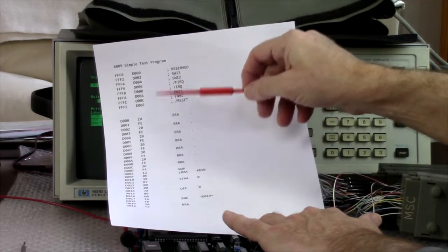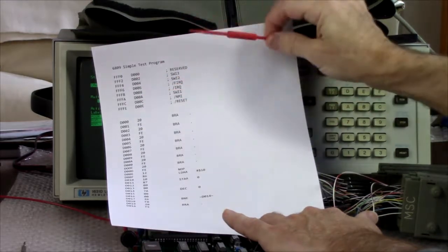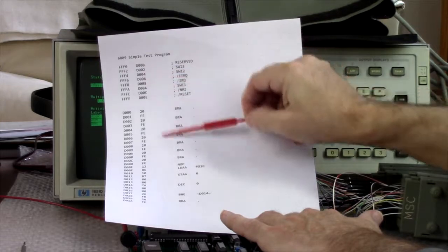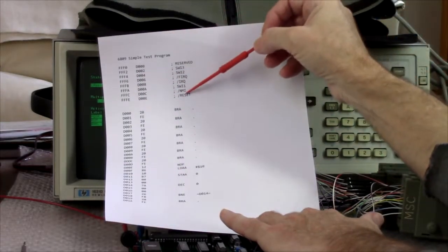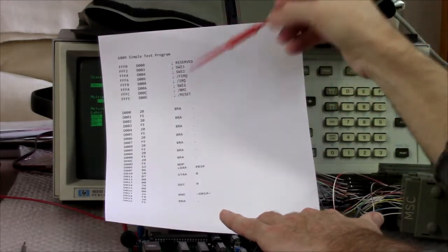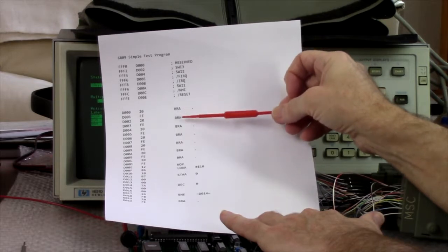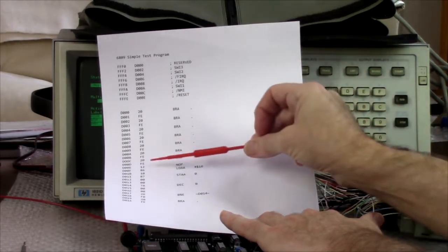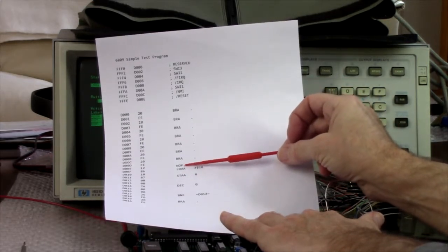And so these are all of the interrupt vectors. I've mapped them all to go somewhere so that if we should get an NMI, for instance, we'll know it by looking at the trace. So this is reserved, SWI3 and so on, come down here. Reset comes to here, D00E, which is an address in the read-only memory.